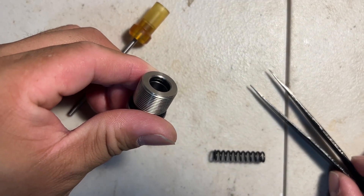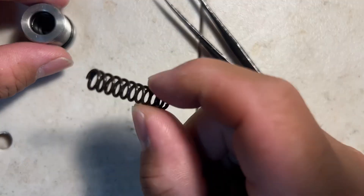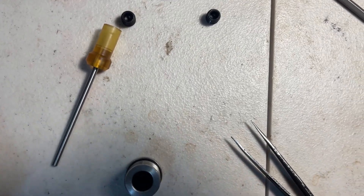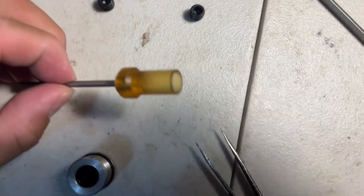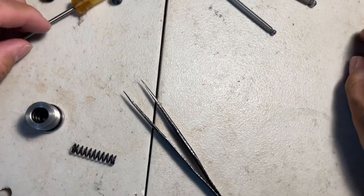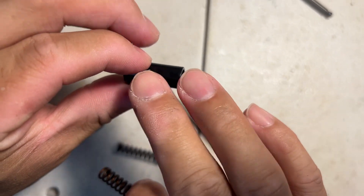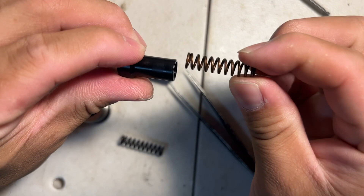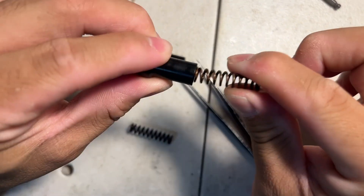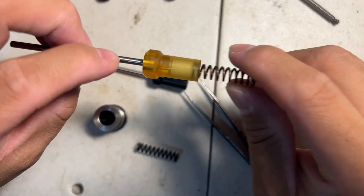Check the o-ring — see if it's still inside. Looks good. You can feel whether it's good or not. If you have the actual o-ring just replace it. Make sure the spring looks shiny — no rust, nothing. Make sure the wall pin looks good. Touch the surface and you can feel if it's smooth or not. This is a broken, used one. Put the spring in so you can tell it's hard. So you can see which things need to be replaced — this is a new one.